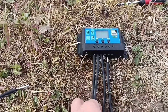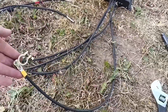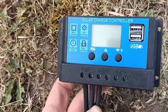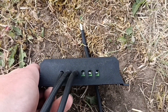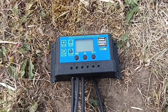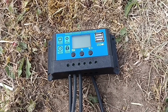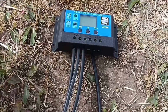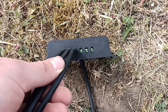And then it charges into the battery. Just got to do one more. There are little screw holes in the front — you put the wires in underneath and clamp them up tight. This is quite a good unit. We've got another one that doesn't have such big holes. We've got quite thick wire here — it's a 4mm squared wire — and there's plenty of room to get that 4mm in.